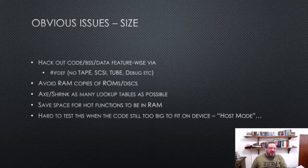So bear in mind that when you're writing code, by default it runs from flash on the RP2040, but that is slower. There is a 16K cache. But especially for video stuff, you need to have some functions in RAM so that they're obviously going to execute with no latency. And so we do all of this,